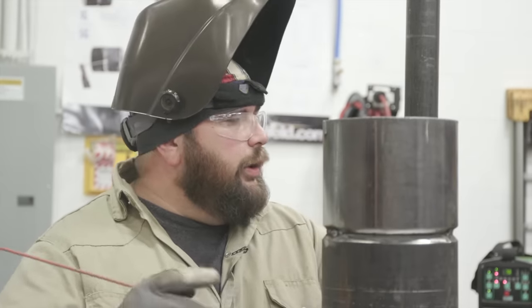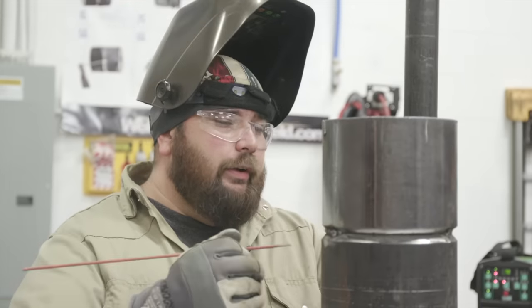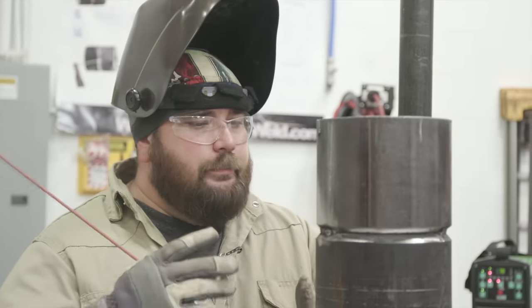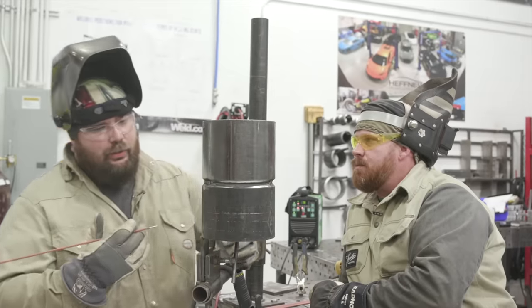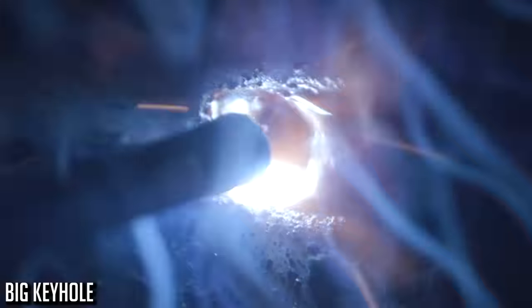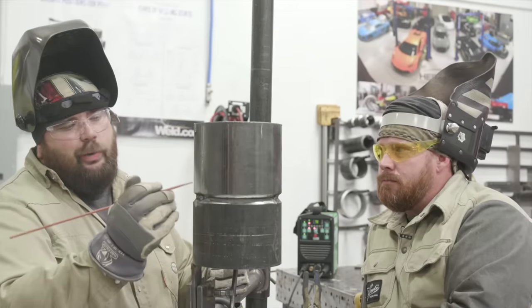Like cooling water loops for natural gas or coal plants could be welded in this process, but like I said, oil and natural gas, API 1104. We'll whip and pause when the keyhole starts opening up a little bit more, but we've got a nice tight gap on this side. It's a little bit open on this side. We're going to try to drag it.